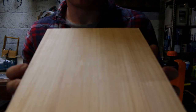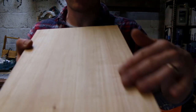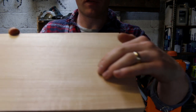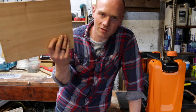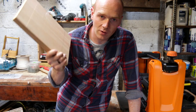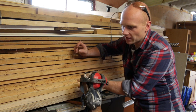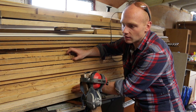So that's our planed poplar — this is only about 200mm wide, maybe a little bit more, but we've got the potential to plane half as wide again. There's the snipe issue to look at on a longer board, but nothing's jumping out at me here. I'm glad we tested it on this bit of poplar because this is really what the whole of this project is going to be about — planing down all of the boards we've got. This is all rough sawn poplar, a variety of thicknesses from about 25mm or one inch up to around 35mm.